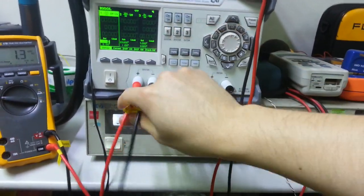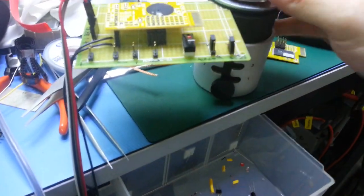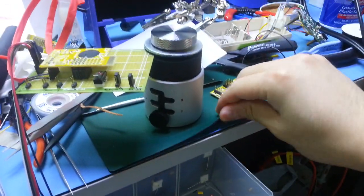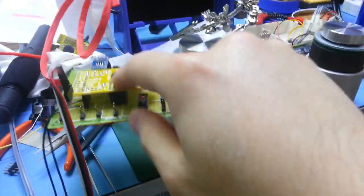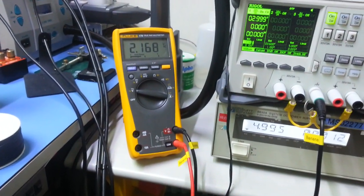If you try to turn it off and use a soldering iron whose tip is referenced to ground, or even if you're debugging a circuit board connected to this power supply and at the same moment you're taking ESD precautions — such as placing the circuit board on an ESD mat — you can still generate 30-something millivolts of AC into your circuit board.